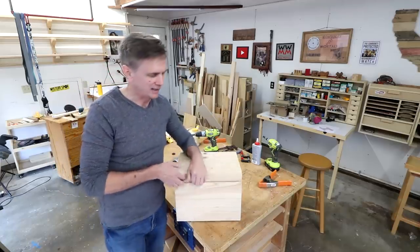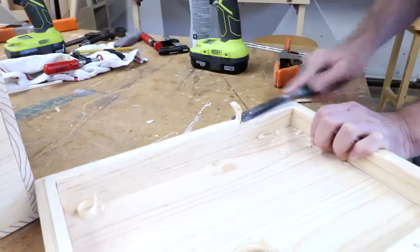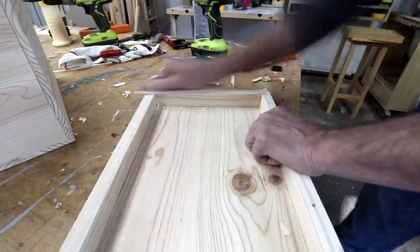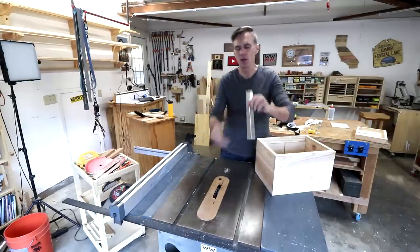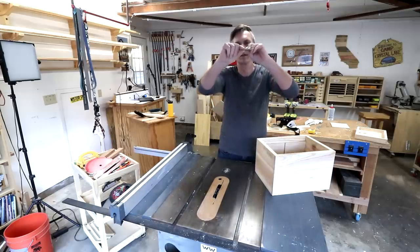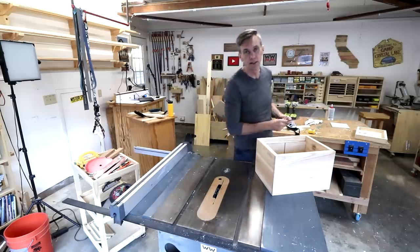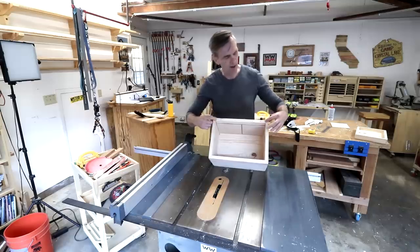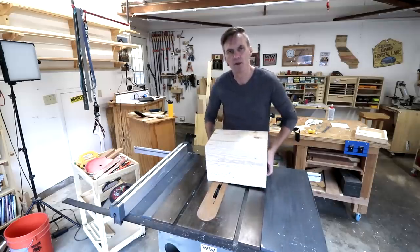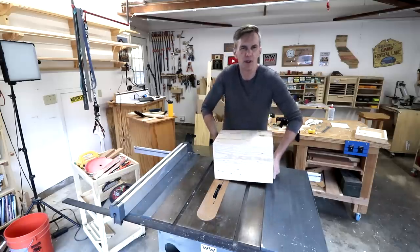So I'm going to do that — I'm going to take these little cleats off and show you how I can do this on the table saw without needing a router. What I've done is installed a stack of dado blades in my table saw, raised just barely above the surface of the table so that this leaf can set down in there. I'm going to start kind of shallow, test it, and see if I need to make it any deeper. I've marked a start and end point of this notch and I'll carefully run this through without going all the way, because I don't want to make a notch on the front of the box. I'll just use my rip fence for these cuts.